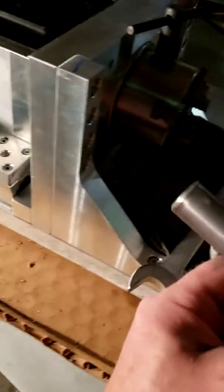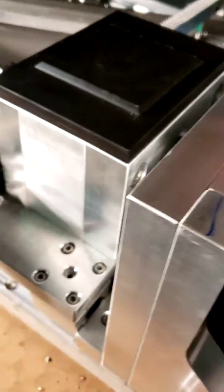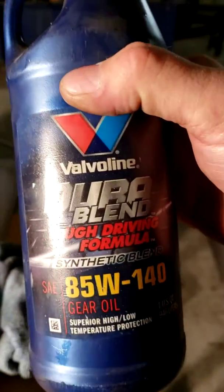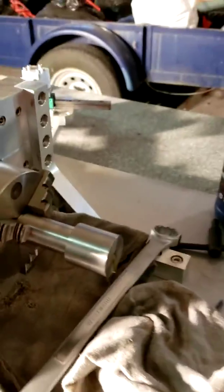The way this works is we're going to put this into the chuck and tighten the chuck down. I'm going to get some lube — this is what I'm using here, 85-140 synthetic. Same stuff that you can get at any AutoZone store. I'm going to squirt a little into the bore, and then we're going to insert the button rifler, the pull rifler.